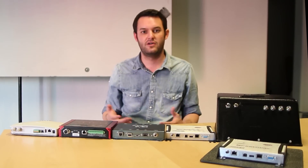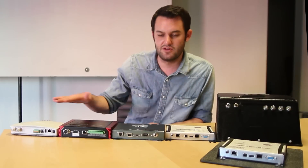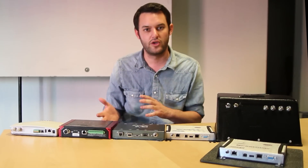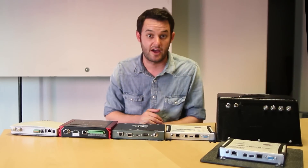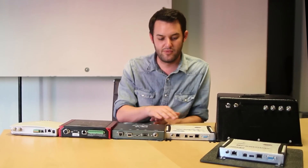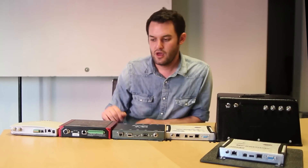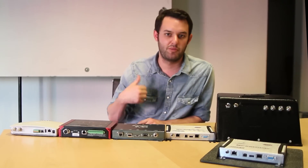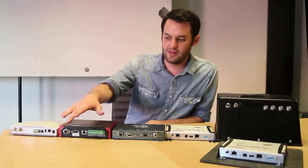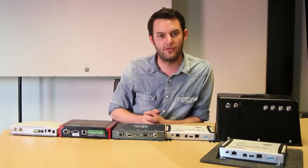Right off the bat you're going to notice a few things. All these units have ethernet — that's a standard connectivity option. You're not bound to wireless and you're not bound to ethernet; you can use either or. Three of them — the Impinj, the ThingMagic, and Motorola — offer power over ethernet. So with one ethernet cable, you can provide both power and network connectivity, making a very simple install process. Alien does not; they have a proprietary power cord.